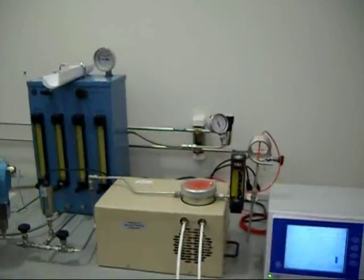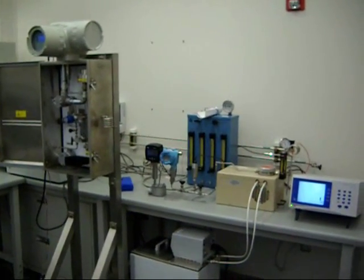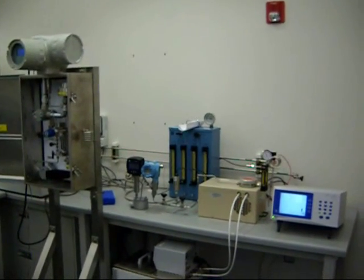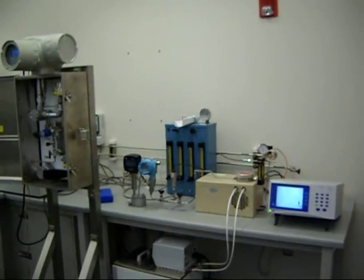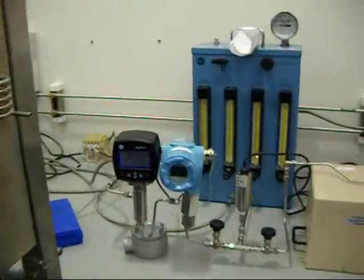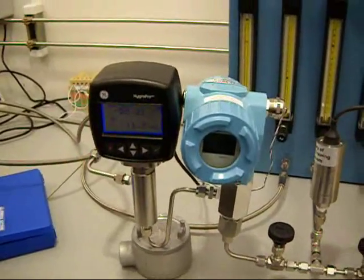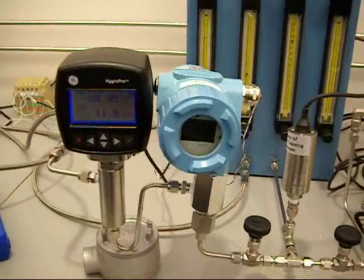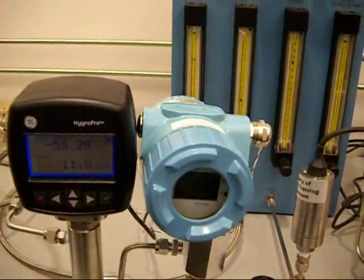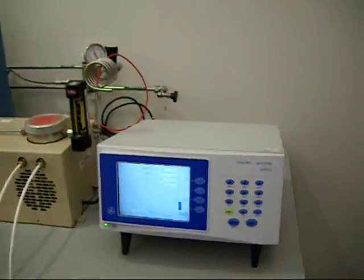The Aurora is extremely fast, and this test has been done in dry nitrogen. One of the advantages of the Aurora is that it's one of the only TDL hygrometers on the market that can also be calibrated and verified in nitrogen. You can use it both in nitrogen as well as switch it to apply to methane or natural gas. Testing also shows that the aluminum oxide sensors are fairly accurate — these are demo units over a year old used in our sales training classroom here in Boston, and they still maintain very good accuracy, typically matching within their original plus or minus two degree specifications.